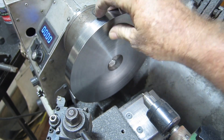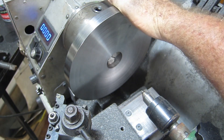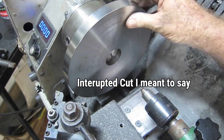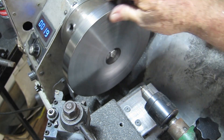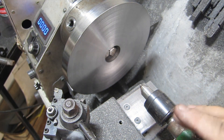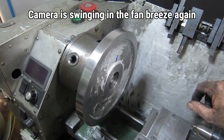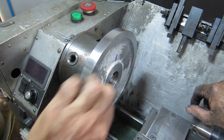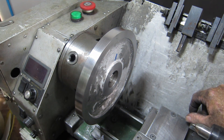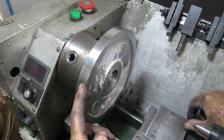There we have it — finally finished this side. When I flip it over, all I'm going to do on the back side is clean up the outside rim and the inside, but I want to get rid of all that lettering and numbering on the back. I'll just take it to the grinder. The finish is not the best, but I want to fly-cut this once I've got the table all finished. Getting in there and grinding them off was a smart move — it didn't take long. Next up I'm going to set up my spindle brake and scribe 360 degree lines around the outside, which will take a while, so I won't make you sit through that.